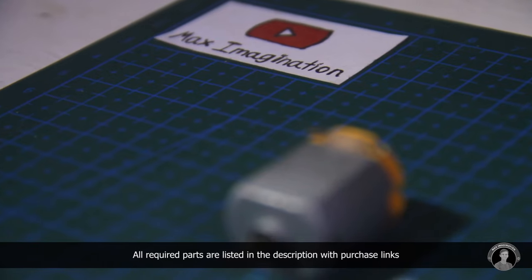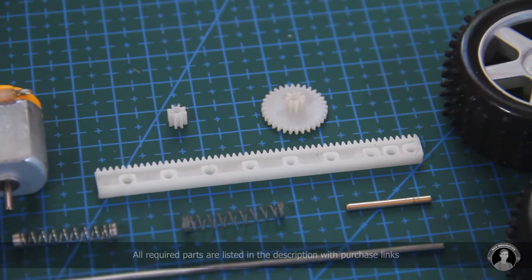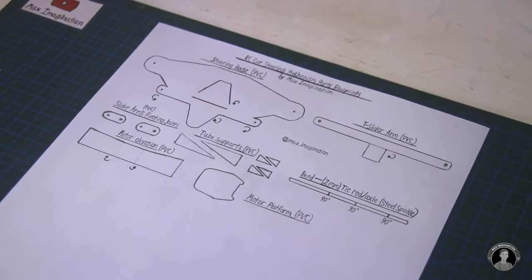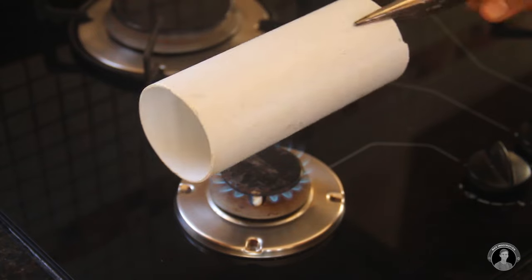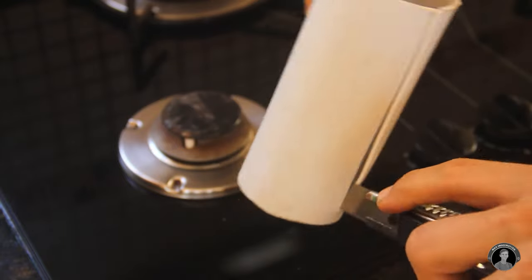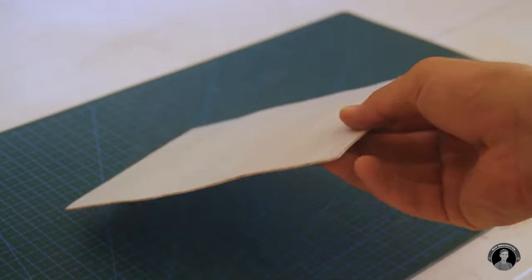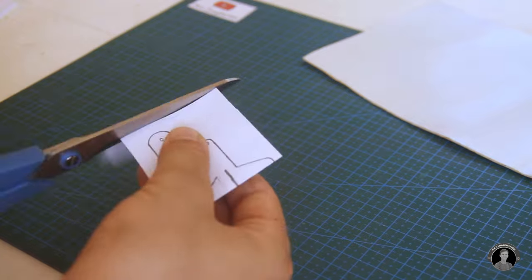Let's first take a quick look at the materials and parts we'll need for the steering. Blueprints for all parts of the mechanism can be found linked in the description below. We'll take a section of thin 2-inch electrical PVC pipe to be flattened into PVC sheet for the mechanism's parts to be cut out of. Heating the pipe up over a stove will help us make a straight and easy cut down the pipe, then unwrap and flatten it into a clean plastic sheet. With a lick of school glue stick, we will stick the sheet of blueprints onto the PVC sheet.